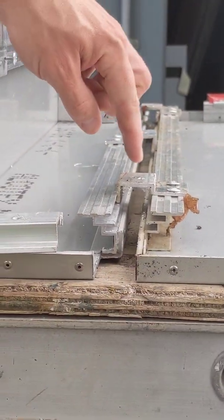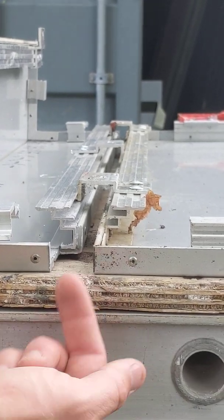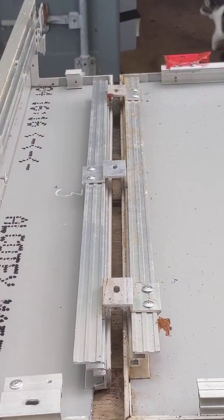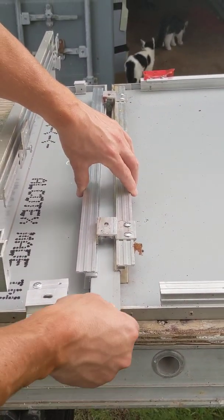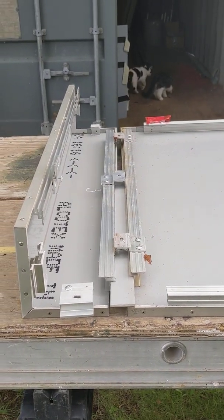Once you've got your panels locked together, you'll be on the exterior side. You'll fasten your clips to your plywood or your Z-bar, whatever you're fastening to. And then typically you'll slide the reveal in after you've got those screwed. Once those are screwed, you slide it in and it's covered. I'll flip that over and show you what the finished product is going to look like.